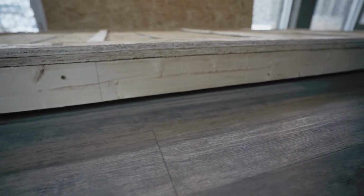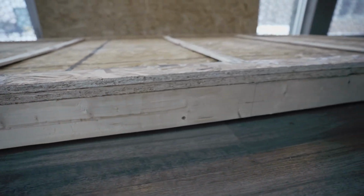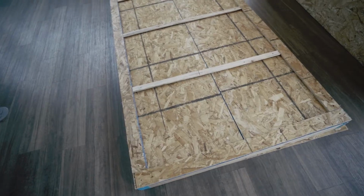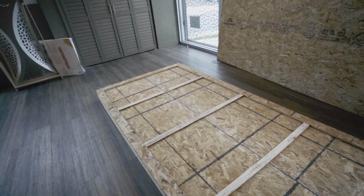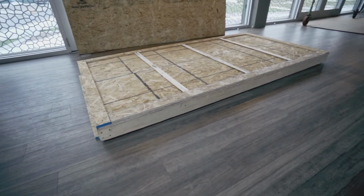The water evaporates and becomes suspended water vapor, thanks to the gap between the panels and a physical process of differential water vapor pressure. The vapor evacuates through the gap naturally. No need to worry about trapped moisture with the STC Acoustic Sleeper system.